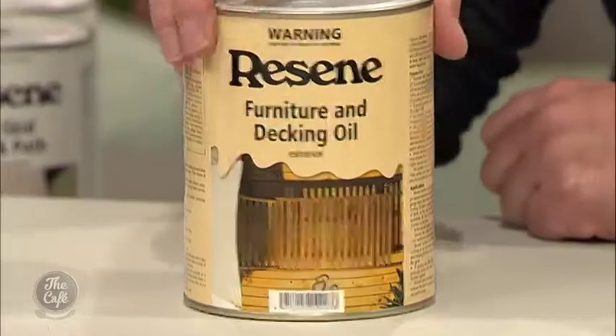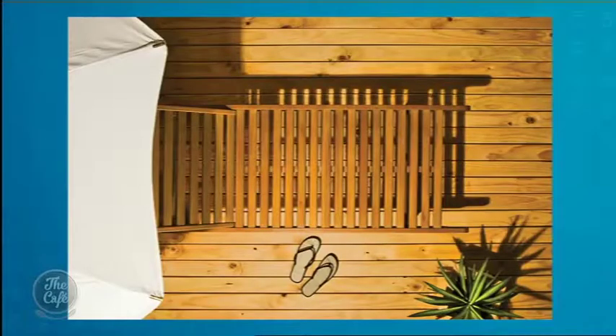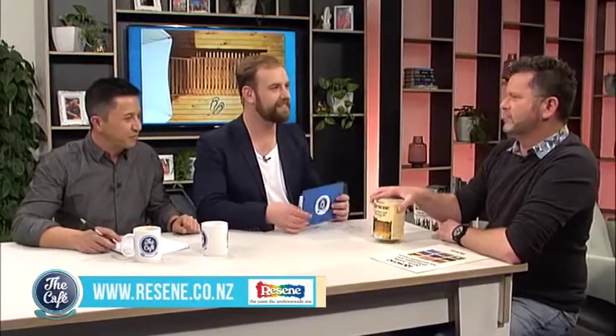I'll be coming around at some point for a barbecue, and I was going to ask about outdoor furniture. Yes, we're going outdoor furniture — what you want to use is a timber prep wash first, get all the algae off your furniture, clean it down nicely. Don't water blast it heavily because it damages the timber — a nice scrub is good. Then you can give it a coat over the top to make it fresh and lovely. This is all stuff you can do yourself. Just go to Resene — resene.co.nz — a very cheap and easy way to take care of it.